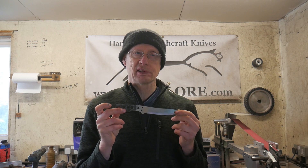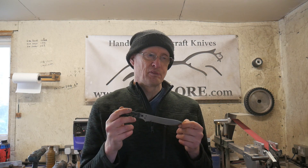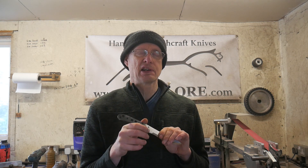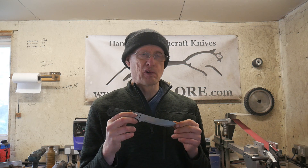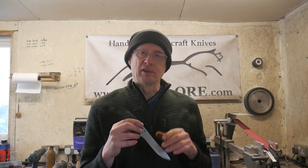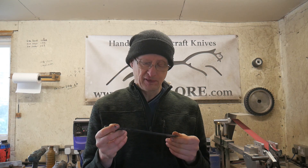I think there's the addition of vanadium or molybdenum in RWL34 which there isn't in CPM154. CPM154 is slightly more expensive than RWL34. I've done some research and it appears that a lot of people are saying the heat treatments of the steels are exactly the same. But in actual fact the Rockwell readings and tempering measurements that I measured were different, so the two steels do behave differently.